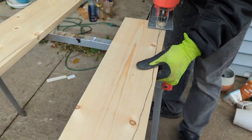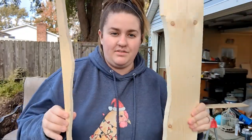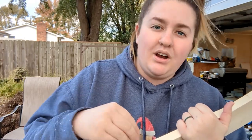That's really the beauty of this project — it can be customized to your space and you can really do as much or as little sanding and shaping as you want. Think of it as sculpting a shelf rather than building it. Now that our piece is cut apart, I'm gonna take my orbital sander starting with 80 grit sandpaper — or you can do it by hand, it'll just take a little bit longer — and get all of these edges really smooth and nice to make it look like it wasn't cut, like it was just there in nature. Then we're going to stain the top lighter than the sides, because if it was actually real live edge it would have bark on it or a darker wood on the outside, and that's what I'm going to try to mimic.